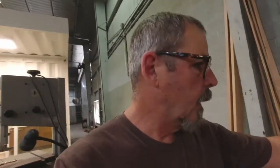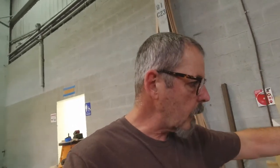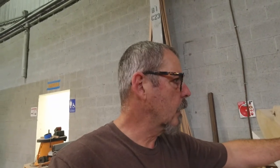So I've got my measurement for my centerpiece of plywood at 44 and 7/8 center to center on those 3/8 ribs, built up to 3/8. It's actually a quarter plus an eighth. So I'll get that cut, and then I'll be ready to soak that in water, get it in the form, get that one out of the form, get some urethane on the front, and keep moving forward.